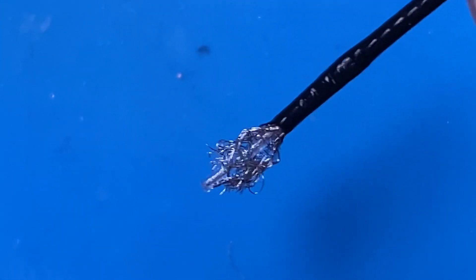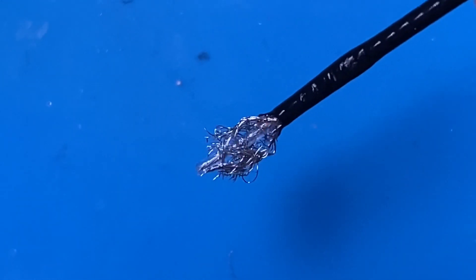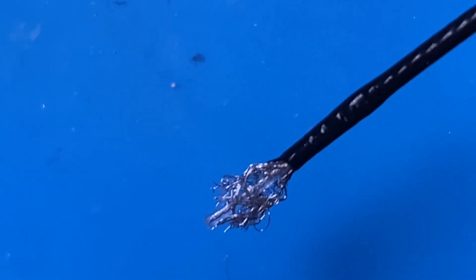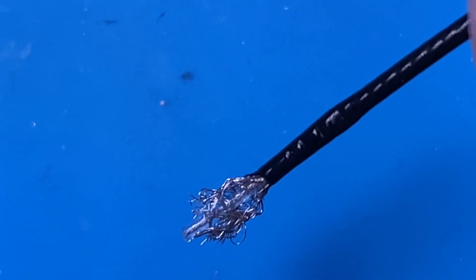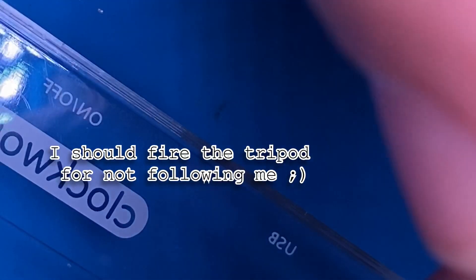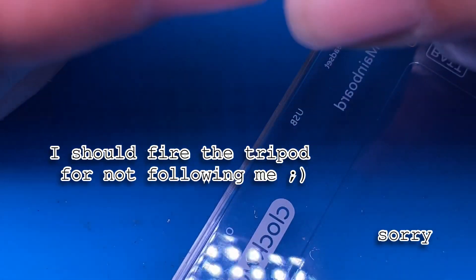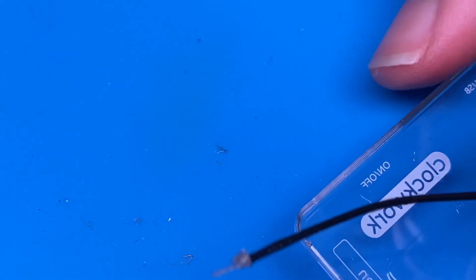If we take a closer look at the wire, you will see that we have two wires inside. One is on the outside — the silver insulation — and one is the inside wire, which is insulated in transparent plastic. Pull all the strands to one side without breaking too many, and make sure you have no loose strands that can fall off. If some fall down onto the soldering mat, make sure they don't get stuck on the PCB later when we go to solder it.